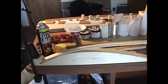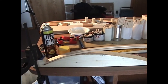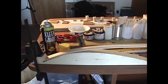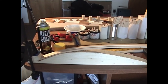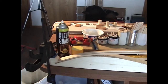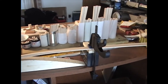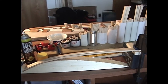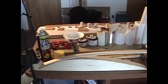Here's my setup to pre-bend the top ribs so that they have that curve into them. They're soaked in water for half a day or a day. Then these are dry right now, but you put them into this jig — there's a slot cut in the front — and then they're clamped down to create that bend and allowed to dry in that position. I can do four or five at a time in this jig.